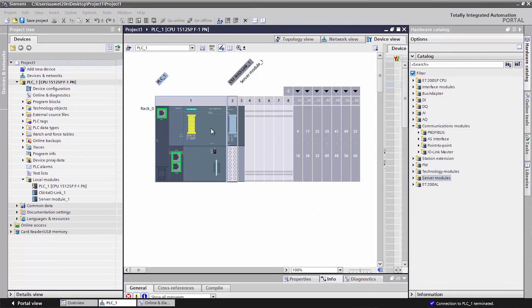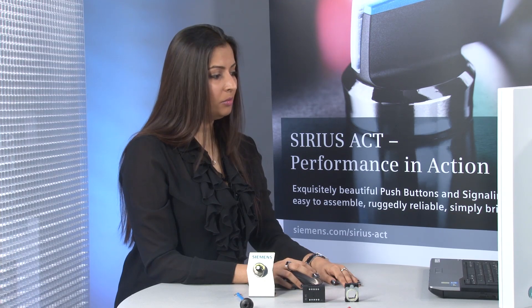I have already prepared a new project in TIA portal. In the project view of TIA portal, you can find the hardware configuration. You see an ET200 SP CPU with IO link master module. The ID key switch will be connected with the IO link master module.